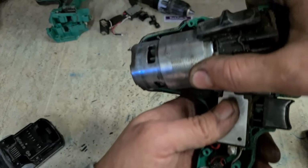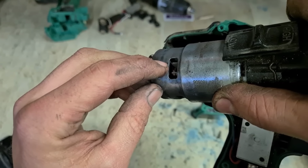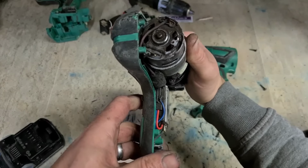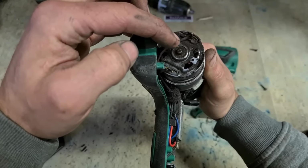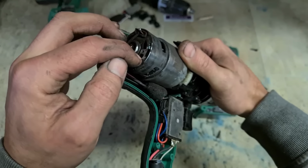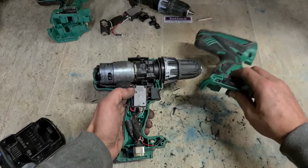And this one's the same. The actual wee brushes inside the DC motor are gone. The bar itself is touching the armature. And the way these sit, one's going across here and one's across there, with the brushes pushed in on top. Brushes are gone. This one, instead of sitting across here, is actually bent around. It's now sitting over the other side. So that motor is also gone.